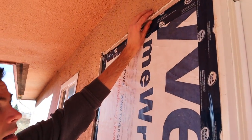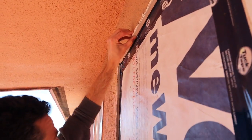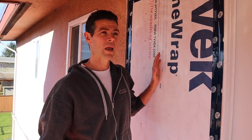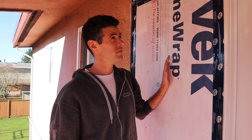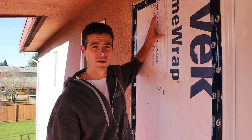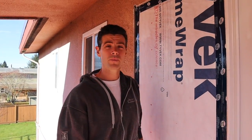First off, this isn't really like three-quarters to an inch thick at all like it usually is — it's thinner, like five-eighths to even half inch all around here. So I don't think we're gonna be able to do the two coats that you usually do, where you do a scratch coat and then a finish coat. I think we're gonna have to do one thick coat and then come texture this tomorrow.